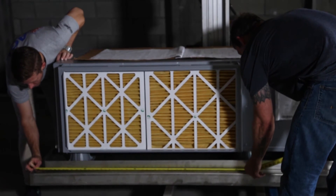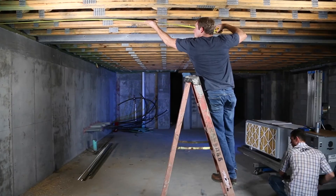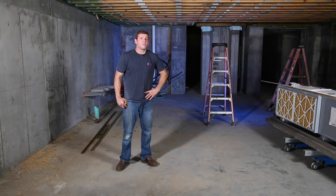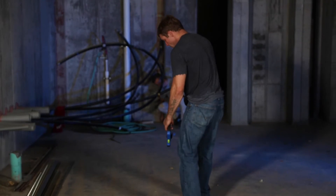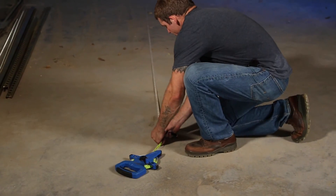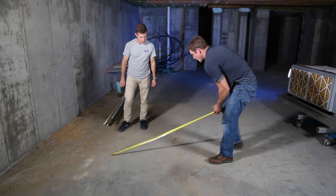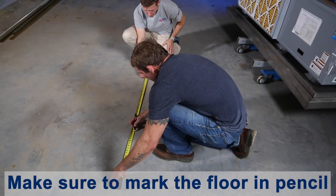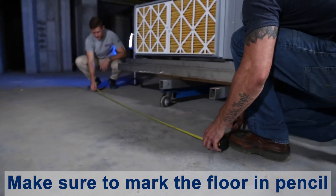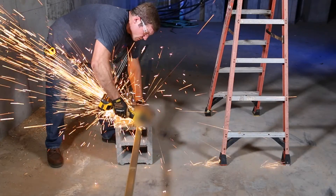Based on our mechanical plan, we know exactly where this unit's going to hang. We're going to confirm that we have enough room for our supply plenum and any takeoffs, enough room for our service, and that we're out of flood. To make it easy on us, we're going to pull marks from reference points around the job — off this rear wall and off this front wall — and we decided to mark these lines on the concrete floor below us just to make it easy to reference, even though they're not needed there. We then transferred our marks on the floor up to the web truss and cut our unistrut to size.